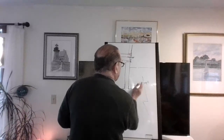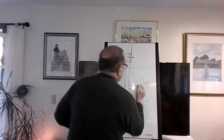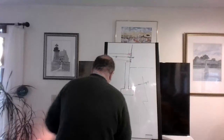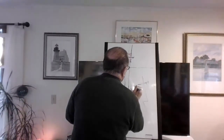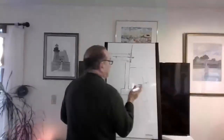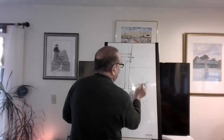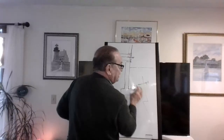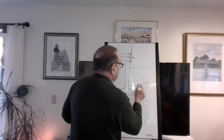If you don't put a shim to kick this up, the water, and I know I mentioned this to one class this year, will build up in there. It happened to me, my own house. Geez, 45 years ago at least. I was an apprentice at the time, but I wasn't aware of this. I knew how the faucet worked, but I didn't know that if this was tilted down, the water would collect in here. And it did. And the cold got in, right? It got in there somehow, and it froze the pipe.